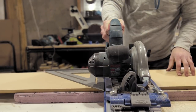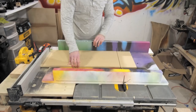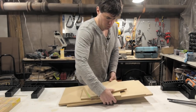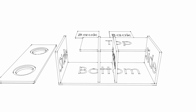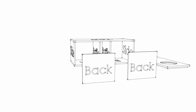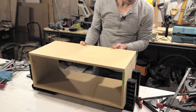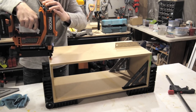Unfortunately I didn't have enough skateboard wood to make the entire boombox from it, so I made the shell for the enclosure from half-inch MDF, cutting down those pieces with my circular saw and table saw. It's a fairly simple design with a box formed from butt joints and two inner baffles that separate out enclosures for each speaker. To assemble the MDF shell I just used glue and my new Ridgid cordless nailer, which I am just loving — not having to hook up the air compressor is a game changer.